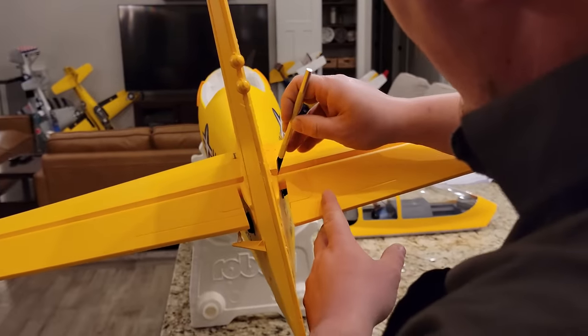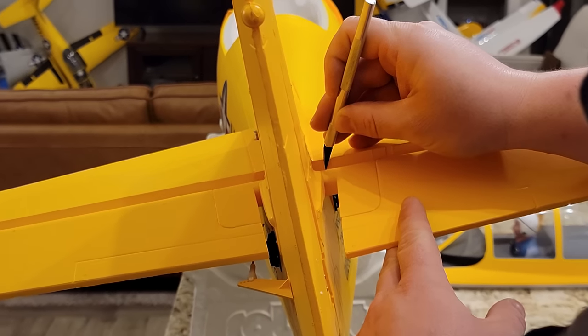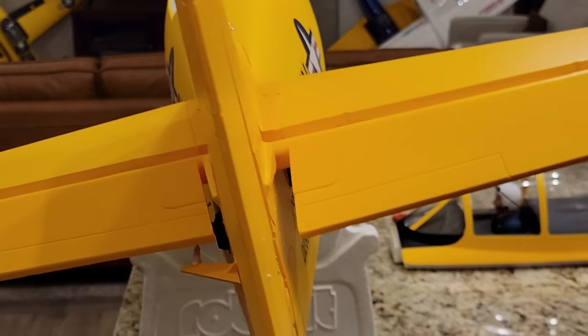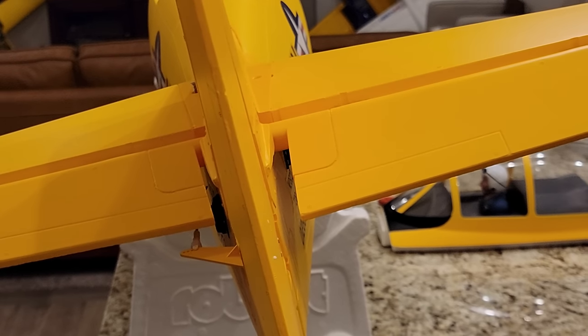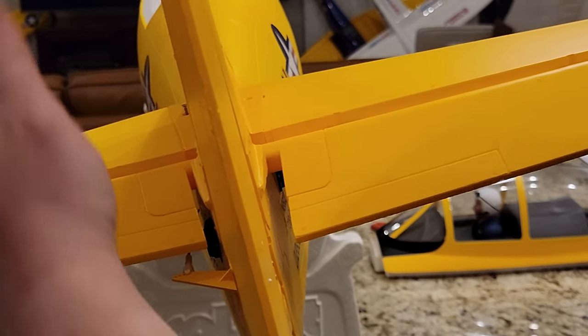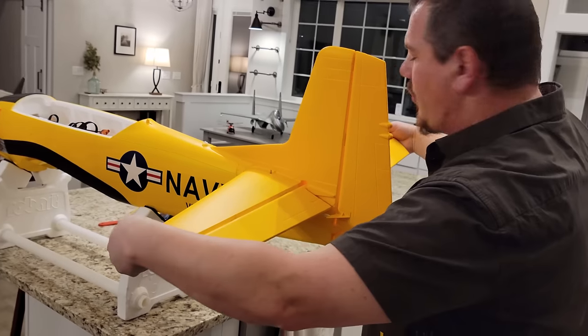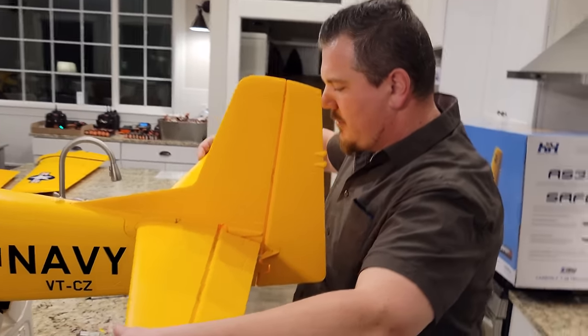You see this right here? Watch this. I'm gonna cut that right there. I'm gonna drop that paint off, okay? Why do I care? Because I don't want a white spot there, because you might see that, okay? Now I'm gonna hold here, surface area, okay? The whole palm of my hand is going on there.